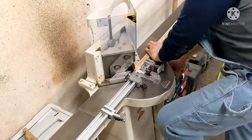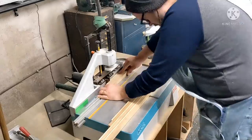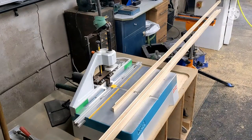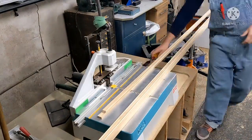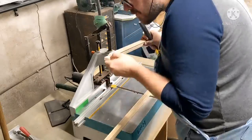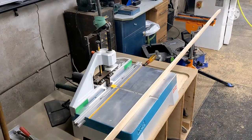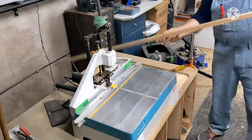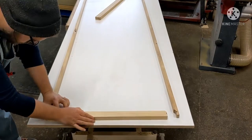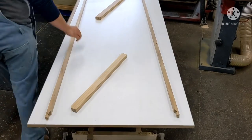Normally you'd run from one end and slide the timber down to machine the notch in the other end, but these pieces are actually longer than the machine bed, so that's set notches at each end. The accompanying machine is the Hoffman dovetail router — essentially a vertical-moving router with a dovetail bit. You pull the handle down, that clamps the piece in place, and the router comes up and cuts a little dovetail. It's a bit like the dovetail keys you see on river tables used to hold splits together, but here it's used to hold the actual frame together. One good thing is it leaves a mechanical fixing that can't be seen from the edge.